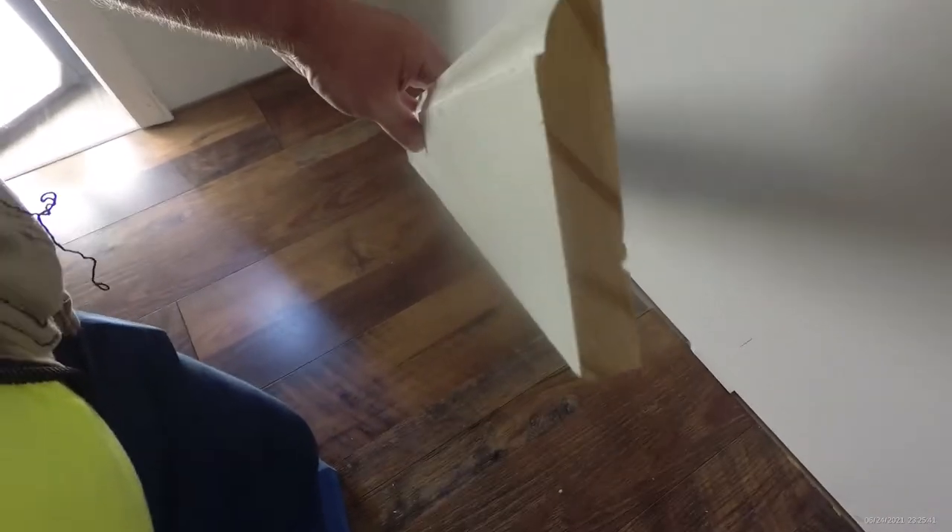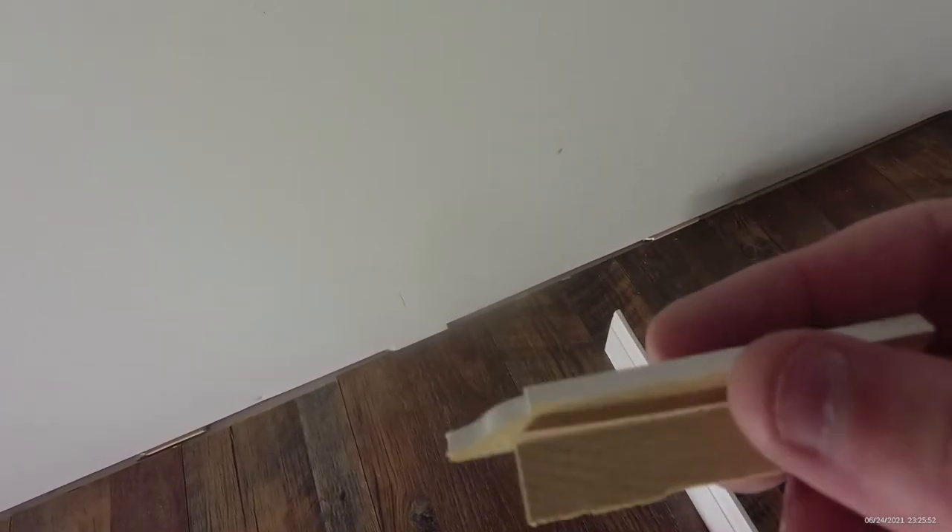What I've seen done in the past — and nobody ever talks about it in the videos, they talk about getting your copes and miters, but they don't talk about this. This is half-inch thick sheetrock, and this floor trim is also half-inch thick. So I take some little pieces of scrap — I just cut them off the ends of some little scrap pieces. They're half-inch wide, but I cut them different thicknesses because the floor gap is different from wall to wall. I cut a few that were half-inch thick, but they were too thick. You just kind of slot them in there — put a little piece in, and that gives you your half-inch.